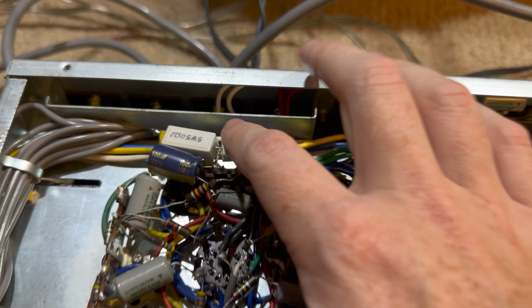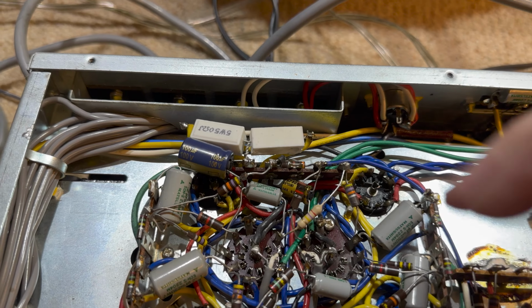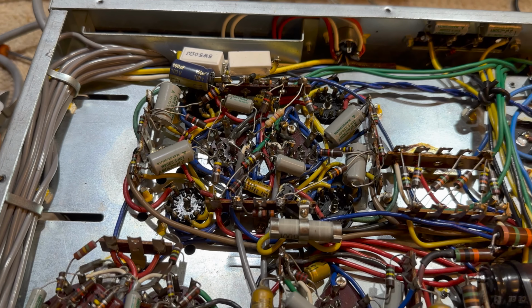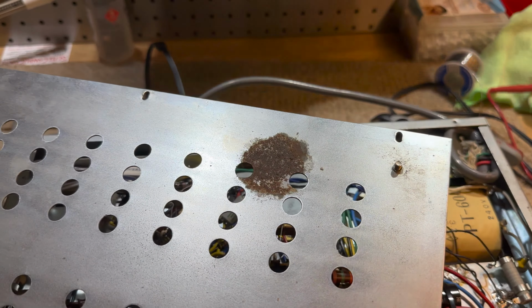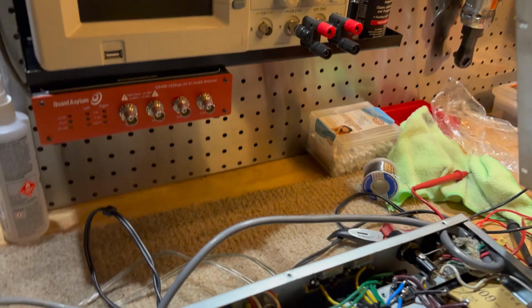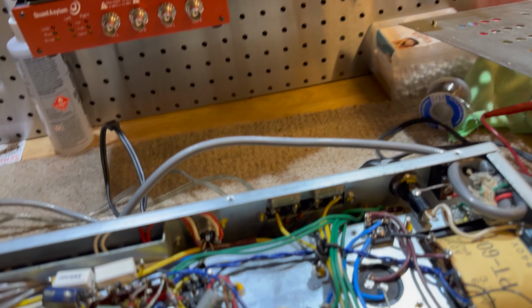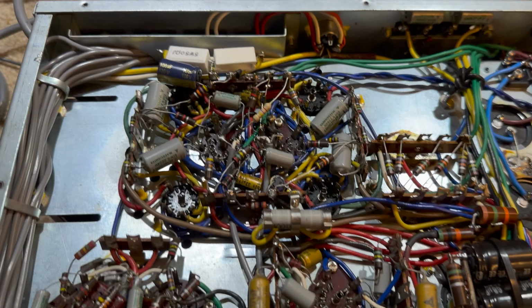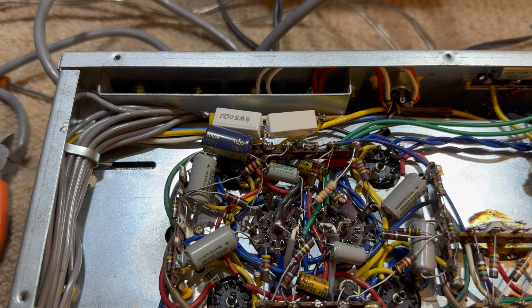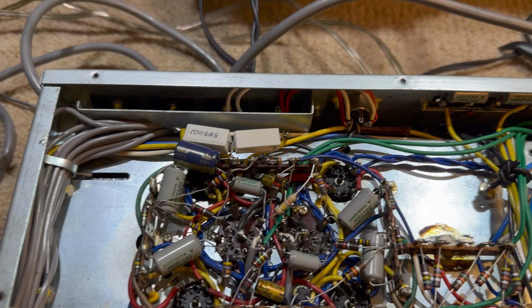These are adjustable. This one I thought was standard, but it's not. It looks like what happened. I was trying to nut out what exactly happened, but there was some corrosion on this metal plate, which happens to pretty much line up with where that resistor was. So I have a feeling it got wet and rusted, and then it shorted out, and hoping it didn't damage anything else, but it does work, so we'll